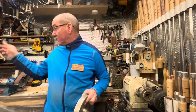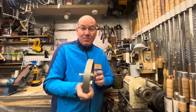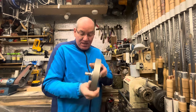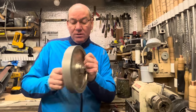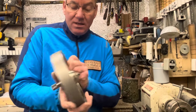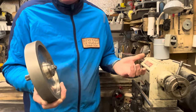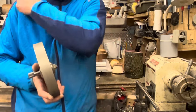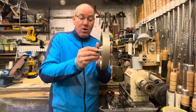So I stripped the grinder down and I took the arbors out. Okay, one for this one and one for my other wheel, which I'll show you in a minute. That's on another system over there. But both can go in here. So I took the arbor out of it and I used the arbor. The wheel bolts on. Okay, it's got its stop there. Bolted it up. I put a couple of little spot welds on here so the nut can't undo. I didn't really need to because I haven't done it on the other one. It's never moved. And that's it. And that's what I mount on.